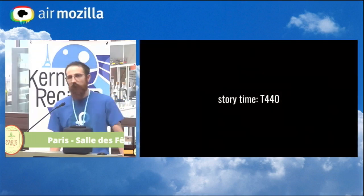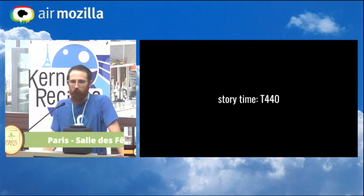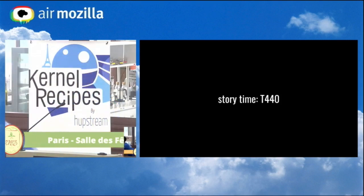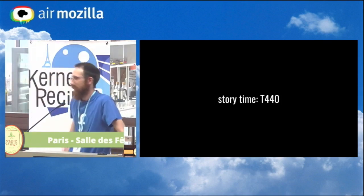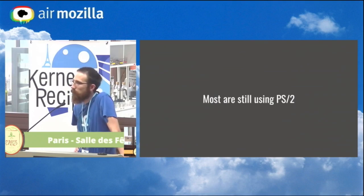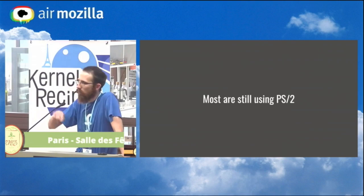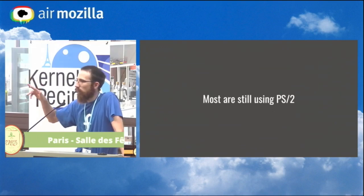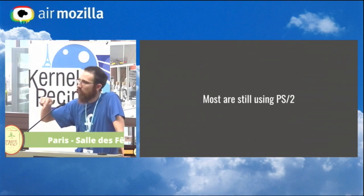The thing is, they're still using PS2, but under Windows, they're not using PS2. They are using another bus most of the time. It's I2C. So basically, it's trapping in SMM and emulating with the BIOS? No. It's at the device level. The hardware does both? Yes. For the Synaptics device that I'm going to talk about, you've got 2 connections, one on the PS2 and one on the I2C. And what happens is that the internal protocol is the I2C RMI4 internal protocol, and then they have a chip on the touchpad itself that converts this into the crappy PS2 thing.